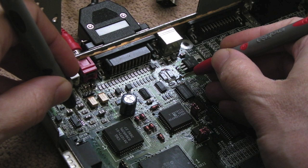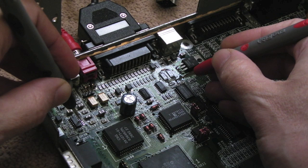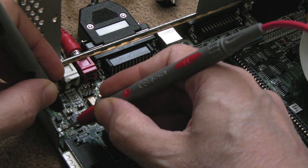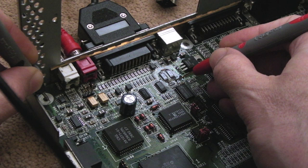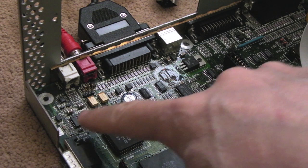Yeah, both those two little wires there go the same way. With regards to the other side, I'm not sure where that goes. Oh, it's ground. Or is it? It's a resistance, like 0.42. I know you can't see the meter here, but I just wanted to measure that. Yeah, minus 12. That's a bit strange as well, actually. I wouldn't expect 0 on one side, minus 12 on the other.